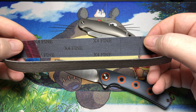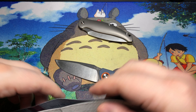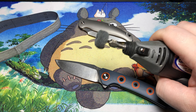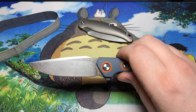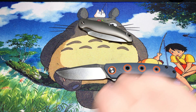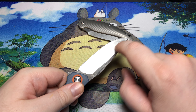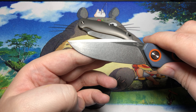When I look at it now, I would pretty much want to start with a fine belt for sanding overall. This is the X4 Fine, which I don't remember exactly what grit that translates to, but it's fairly fine. I would probably want to finish that up with some sort of Scotch-Brite — you can use a pad, and I do have those, but this one sits constantly on my desk. Different grits are available, which is probably fine for most steels, especially 14C28N which is fairly easy to scratch. Generally you don't want to go in a single direction because it's going to be very visible, so I ended up doing some swirls as well as back and forth — and yeah, it worked out pretty darn well.